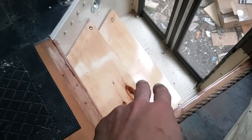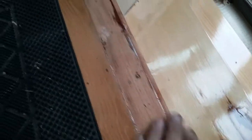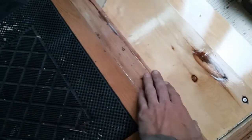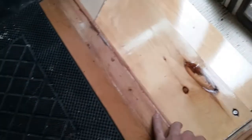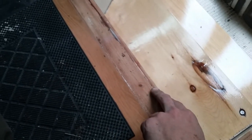The stairs used to be black, as you guys probably remember. I'm starting to do the steps in wood with a weathered look. It's stained with mahogany, but after I polyurethane it, I sand it down, and when I stain it, the stain goes on the parts that are sanded all the way to the wood and only stains the other stuff lightly. So it gives you this weathered look. I'm also going to put protective corners on here.